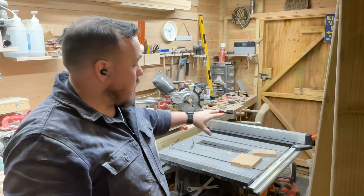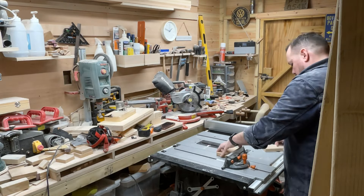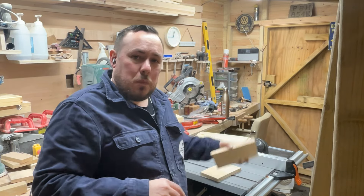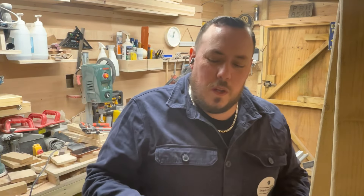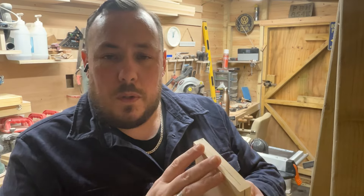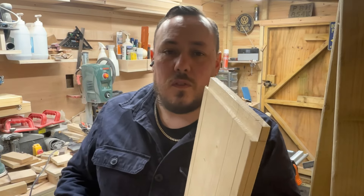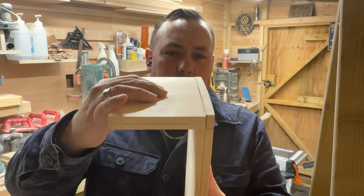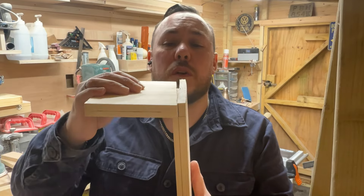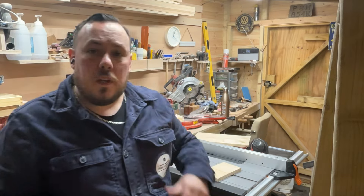I've got that roughed up and the fence set up. You may have missed some steps, but you experienced guys will know what I'm doing - I'm basically taking this part off all the way along and then joining the box together that way. I've already done the long side parts and it all fits together quite nicely once it's all sanded down. There is a slight cup in this board but once it's glued up and clamped it'll be absolutely fine. The next step is to do the same for the top and bottom of the box.